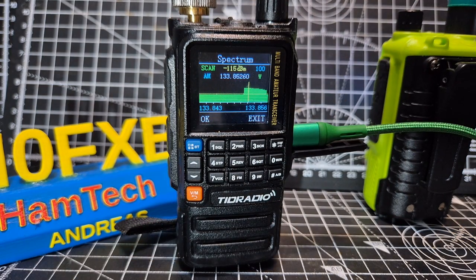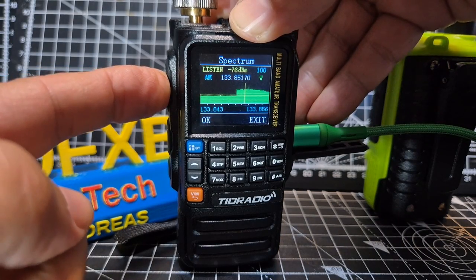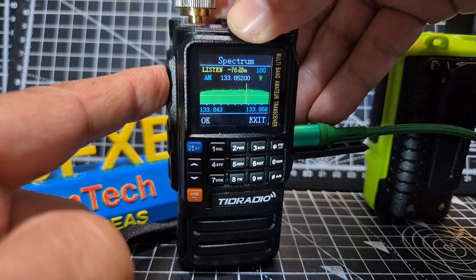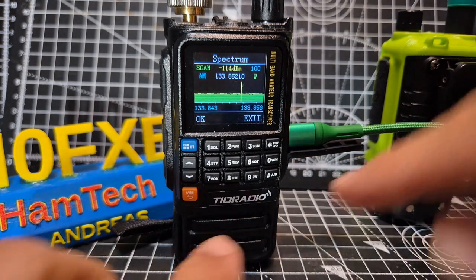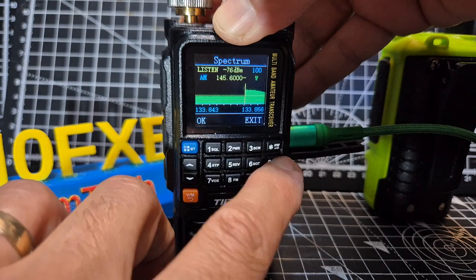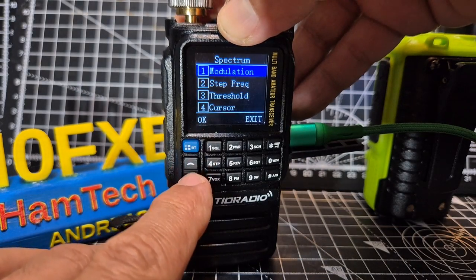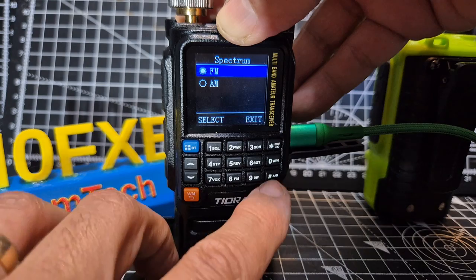You can hear Crystal Tower there. Press PTT to choose the cursor frequency and monitor — remember we can't transmit on air band, it won't allow it, but it just turns off the squelch. It says scan and listen. Nought to nine lets you just type a frequency like normal, so you can type in, say, 145.600 — that's GB3 WR. Then go to Menu, modulation, and select FM.